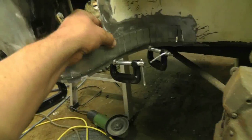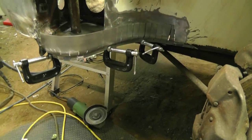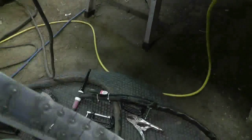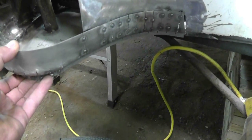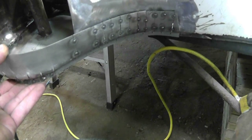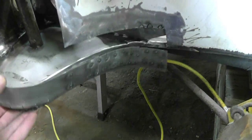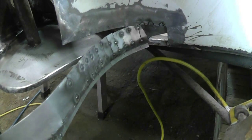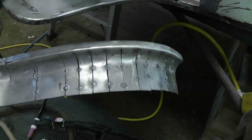I might not have left enough to really do a decent flanging anyways. But regardless, let's get this all tacked together. So there's the item tacked together and it's nice and solid. So I'm going to take this over and fill this in, and then we'll bring it back and we'll weld this in. I got to trim this and decide — before I go I want to finish welding this. I'll clamp this back in here and trim it back to this height here, and then that'll be where I'll weld to. I won't weld any more than I have to.